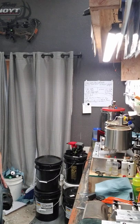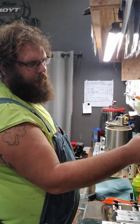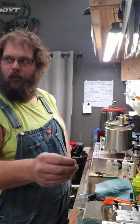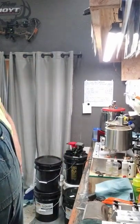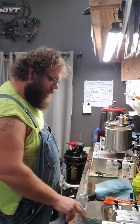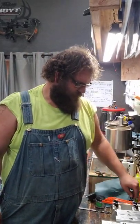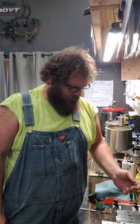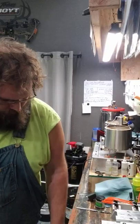I'm looking at molds where you can shoot just the tail first, then slide a brass piece and shoot the body into the other side, so that you do it within 4 seconds of each other to adhere. But that mold's about $2,300. Oh, Lord. That's a lot of plastic. Still a little warm.